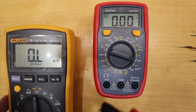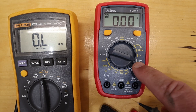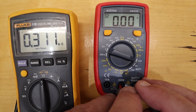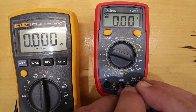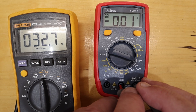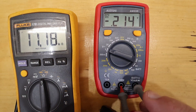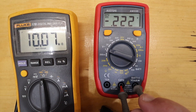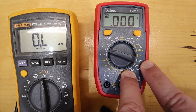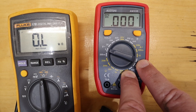It's fairly easy to prove. With another meter in its ohmmeter setting, measuring the resistance between the terminals on the 1.5-volt range, the meter declares about 32 ohms. Switching back to the 2-volt setting, the meter declares very high impedance — around 10 megohms. So the battery range is a DC measurement with a small resistor in place to load the cell down for a more accurate reading.